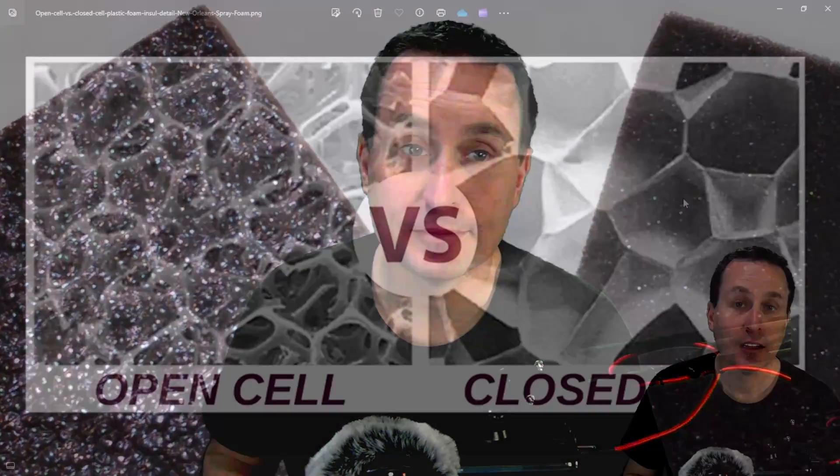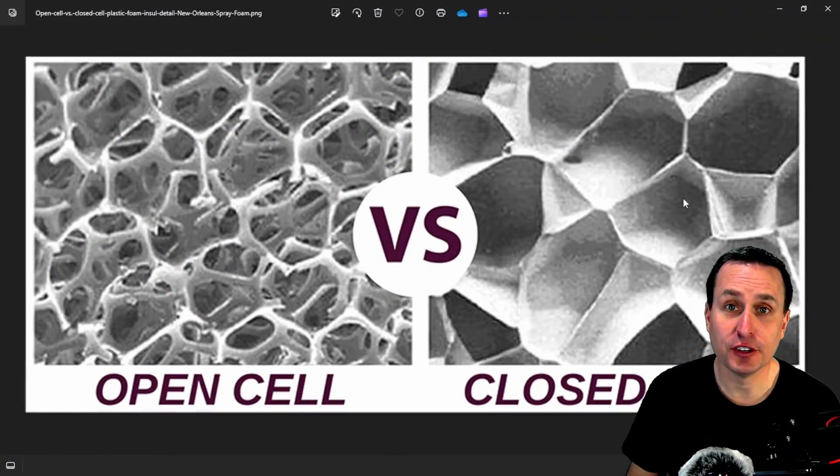Isolating the barometer is really just the same thing we do with microphones. For example, this is a microphone without any type of filtering or a pop filter fuzzy. Using the same microphone with a fuzzy on it, you can see there's quite a bit of difference. That's what we're trying to do with the foam. There are two types of foam you need to be aware of: open-celled and closed-celled foam — and you can see this microscopic view of the different foam types. We want to make sure to use the open-cell foam type.